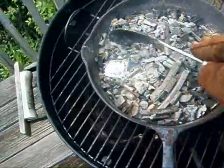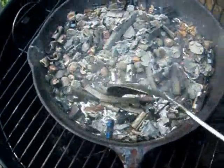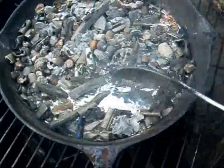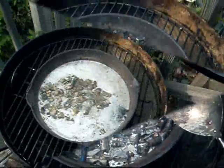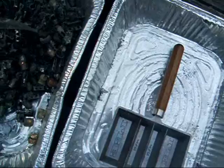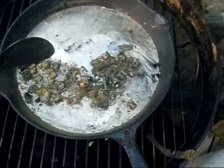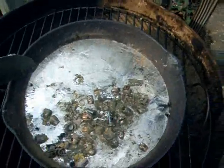We are at the point of melting. You can see we've got a lot of liquid metal starting to form. We've got paper burning off, grease and goo — but it is starting to become liquid. All those bits of steel will end up floating on the top. Now I've got most of the junk out — steel clips, bullet jackets. Here's a square stick-on wheel weight made of zinc; it doesn't melt in lead, so just want to get those out. The copper and steel float on top of the liquid molten lead, so I'm going to get all that garbage out.